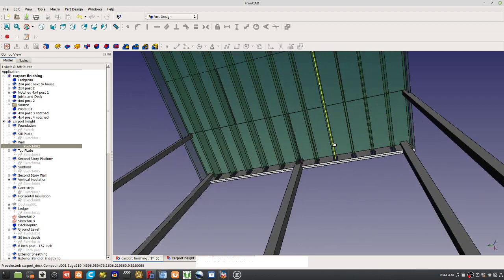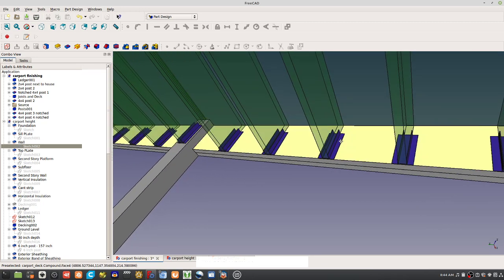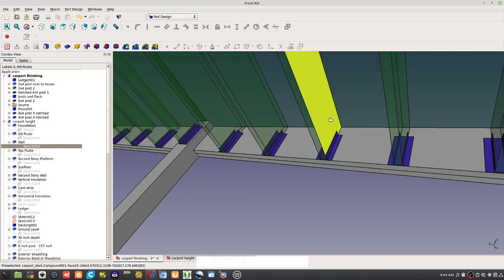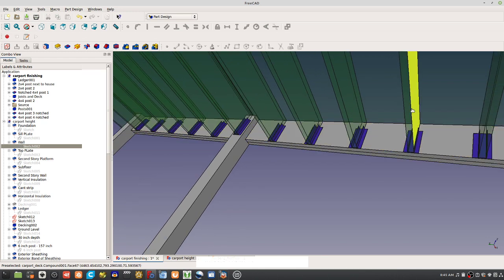It's actually 16 inches. Typically, we're used to 24-inch spacings. And also, the other detail here is we're going to have joist hangers hanging these things up, because now this is not laying on anything, so we need hangers. We didn't use joist hangers before because all the time the joists were resting upon the top plate. Here, they're not. Here, you've got to hang them using 2x12 joist hangers, and I just drew those in.